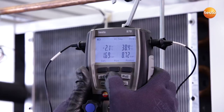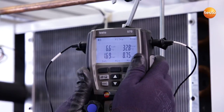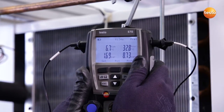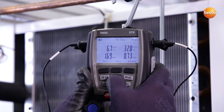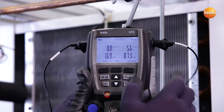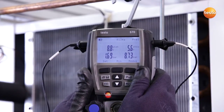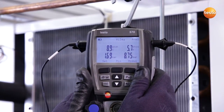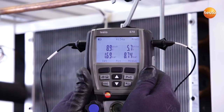This suits the ambient conditions very well right now and by pressing this button I can also see how the probe temperatures can be read out. On the one side we have a temperature of 6.7 degrees Celsius at the exit from the evaporator and the liquid temperature of 32.8 degrees Celsius at the moment. If we switch further, we obtain the values which are so important to engineers in the field, namely subcooling and superheating. On the left we see the superheating of 8.8 Kelvin right now, measured at the valve, and on the other side a subcooling of 5.7 Kelvin before the expansion valve. These values are good enough. You could alter the valve value a little, but basically the system is very well adjusted.